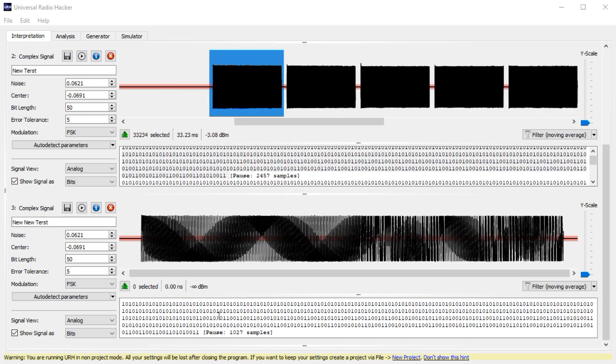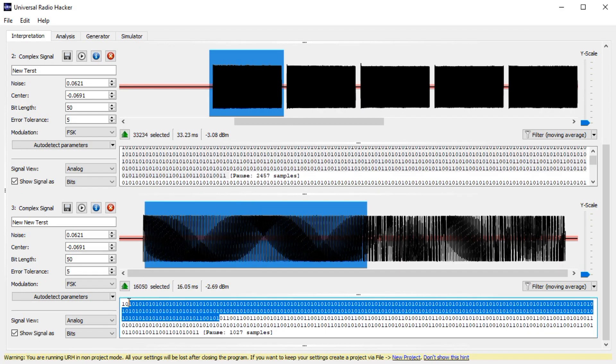If we zoom in, we see a typical behavior of a 433 MHz sensor. They first transmit a so-called preamble, which usually consists of ones followed by zeros. This trick helps the receiver to adjust its clock, its gain and its frequency. We have to keep in mind that these devices must not cost a lot and therefore are not very precise. After this preamble, they usually send a sequence to synchronize the transmitter and the receiver. The synchronization signals have to be different from the preamble and not have a regular pattern. This sensor seems to be an exception — it does not send a synchronization signal.